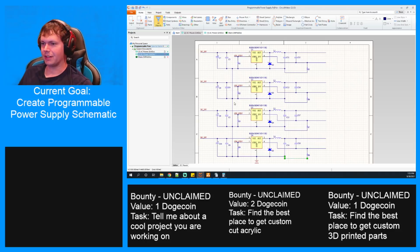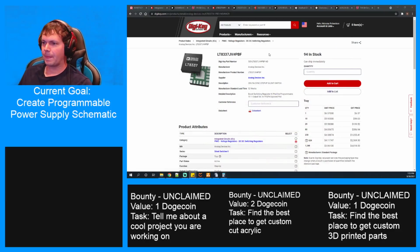And then we've got to find a potentiometer that can actually adjust that value and get all new components here. Alternatively, I'd like to just go ahead and do the 24 volts, but I guess we're not getting there. So if anyone comes across anything that could do it, some sort of digitally controlled potentiometer that can handle 24 volts, that would be awesome.